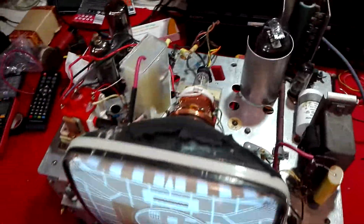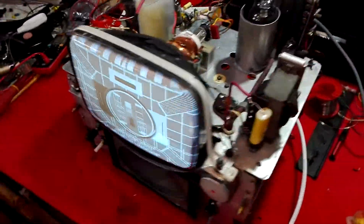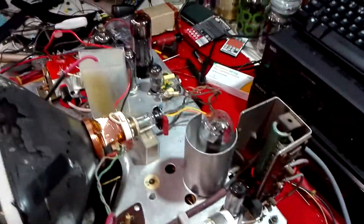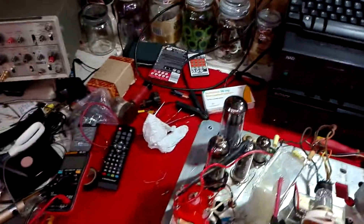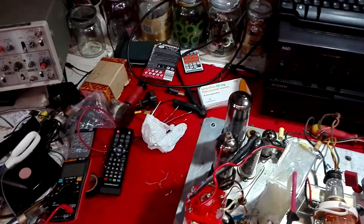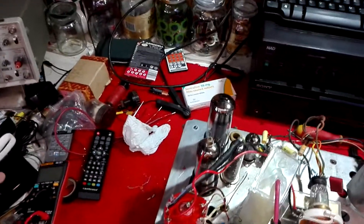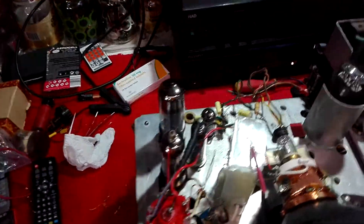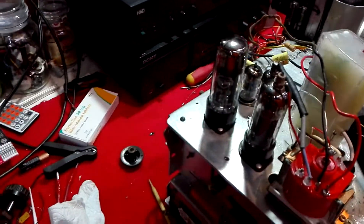The previous tube was in fact a radar tube that was fitted to the set. The set has a capacitor heater dropper but still retains the standard line output with valves. Instead of a PL-30 it's a PL-36, it has a PY-81, and instead of the PZ-30 it has a PY-33.